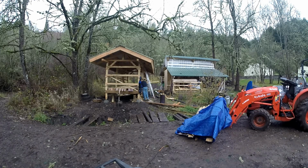So, like I said, anytime I'm trying to get to a point where I've got that main cant, and I'm cutting off little 1-inch strips, if they're thick enough to be an actual 1x, then I can use them for siding and whatever. And if they're too much wane, things along those lines, then they can be set aside and used for all kinds of little crates and projects like this.